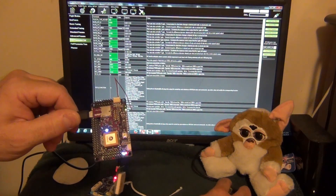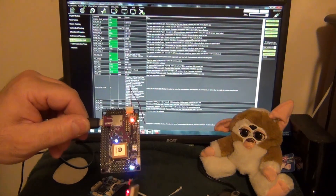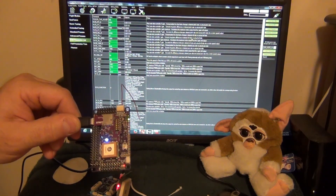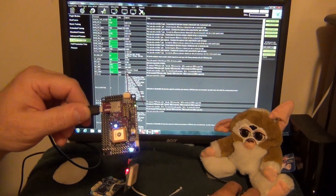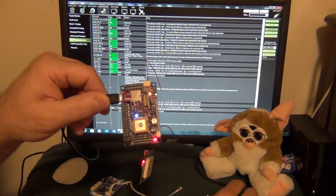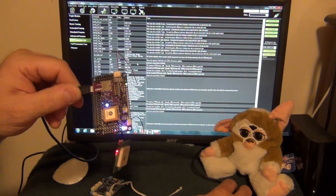When things change they turn green. I'm going to hit Load from File again with the original eBay mega param file and open it up. The screen turned green everywhere — those are the things that changed: your rate, rate. If you read over on the right-hand side it explains everything you need to know. There's a lot of information, you can learn it, play with it, and keep it going. It's nicer to have a drone where the Arduino board is accessible, or to do the USB mod so you can bring a laptop to the field and tweak the settings. I need to make sure the write happens — you've got to hit Write Params.